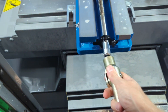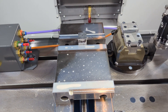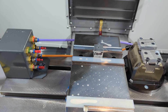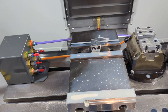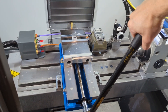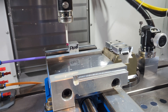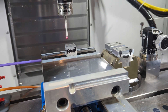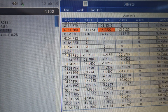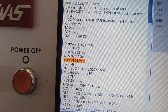Load your work in progress onto parallels in the vise. You should see the word 'front' at the front, and your clean machined surface with the dot in the middle on top. Seat your work in progress onto the parallels with a plastic mallet to increase perpendicularity between the top and the sides you're about to cut. Torque the vise to an appropriate amount of foot-pounds — appropriate meaning the number you've arrived at based on experimenting with how too much torque can crush your material. Then probe the top, left, and back of your material, find your personal work coordinate system — for me it's G154P80 — and write down your X, Y, and Z coordinates. Then look at your G-code and confirm you're using that same work coordinate system.